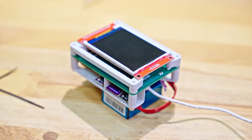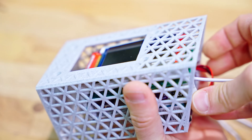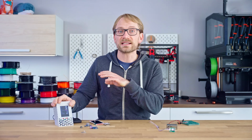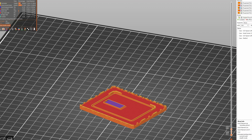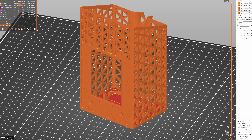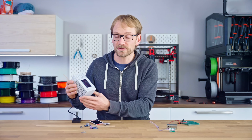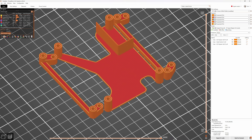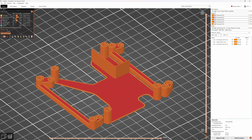You'll end up with a controller pack that is fully built and functional, and that then simply slides into the outer shell. This design made everything easy to assemble and easy to print. The shell gets printed upside down, it doesn't need any support material, and you can print it from any material and color you'd like. The other parts are the spacers for the screen and the shelf for mounting the wired sensors, and both of those are also simple prints that any printer should be able to handle.